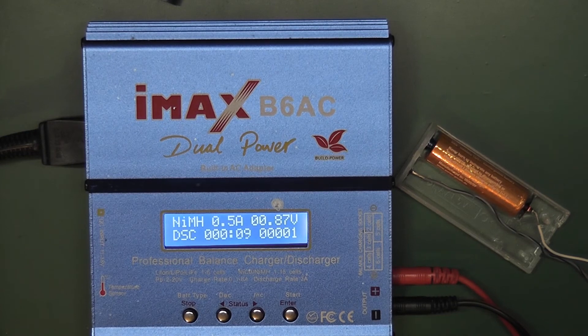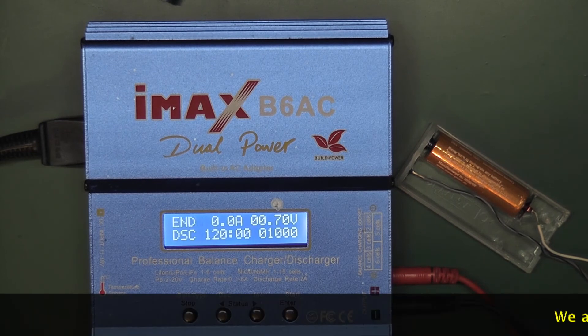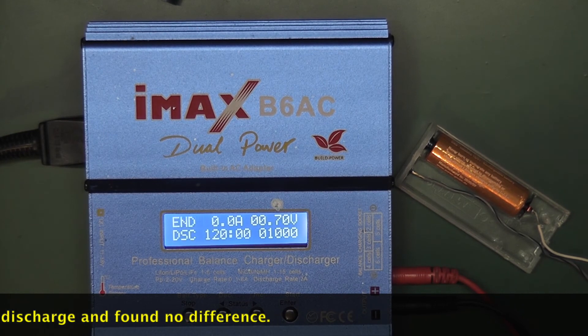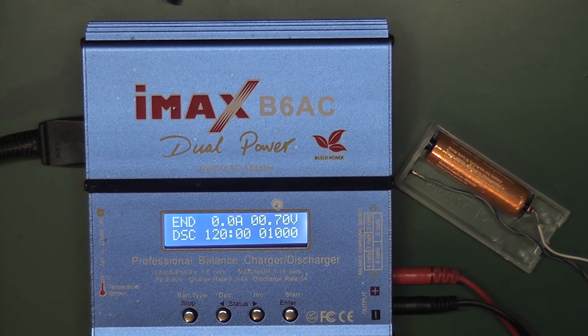This may take some time so I'll skip to when it's discharged. Exactly two hours later, discharging at 0.5 amp or 500 milliamps, it took exactly two hours and it's reading 1000 milliamps — so in effect the battery is really a 1000 milliamp battery. Correct me if I'm wrong, but your average household item — flashlight, camera, whatever — wouldn't be using much more than 500 milliamps, so you may get a little bit more out of it or you may not. I hope you found this video useful. They're about five euro to buy, or the equivalent in your own currency. If you enjoyed this video give us a thumbs up, don't forget to like, share, subscribe, and we'll see you again soon.